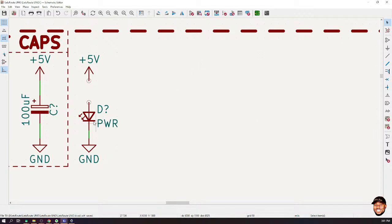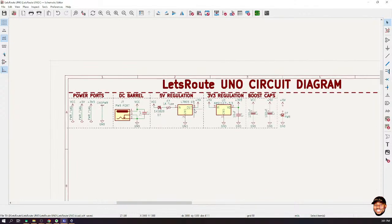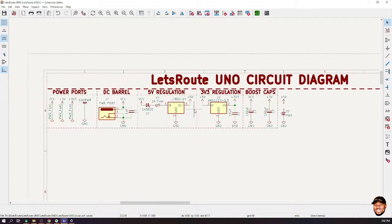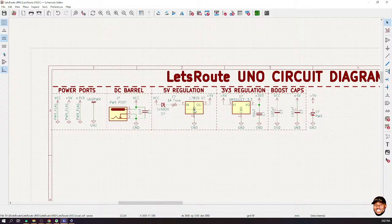Okay, and then the amperage. I see you put in a 1 amp fuse, polyfuse. Yep. So are you restricting it to only 1 amp maximum current? Yep. You see, the way current works, current is always a reaction to voltage. Know that you don't force current into a system. The system determines what current it needs. You can only set the voltage the system needs, and it will handle its own current.